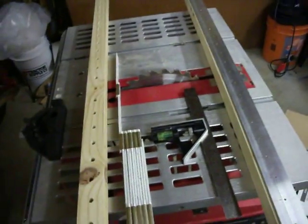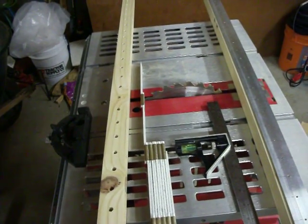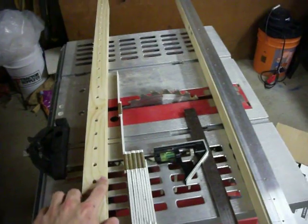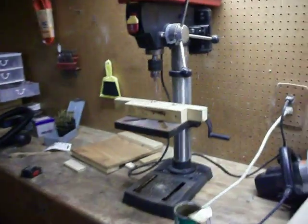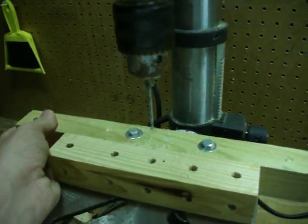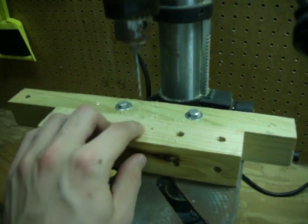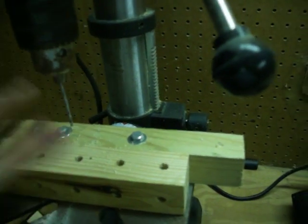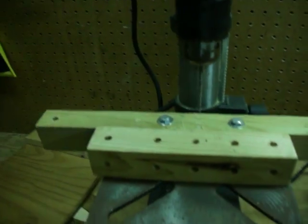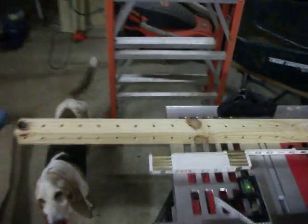How I get this set up is — I used to measure each and every one of these holes painstakingly and mark a horizontal line across where the holes need to be drilled. Then I take them over to my drill press, and on the back of this I mounted a piece of wood that ensures the tip of the drill bit goes down to exactly 3/4 of an inch from the edge of the wood, where the holes need to be spaced. This has served me well and been pretty reliable once set up. The only problem is I had to measure each and every hole.